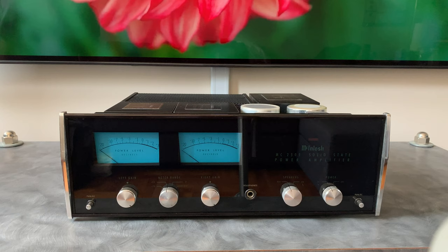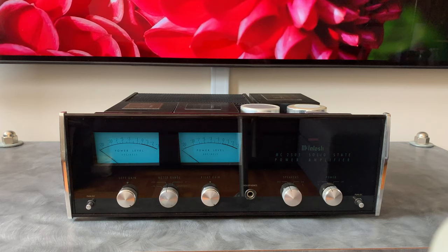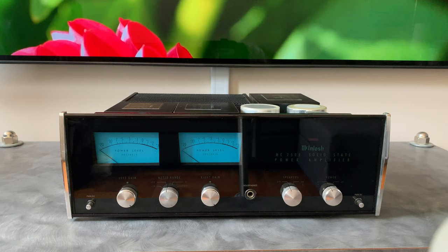As I mentioned earlier, there's different versions of this piece. When I put the new glass on, I noticed that the meter range indicators for off, 0, negative 10, and negative 20 were shifted by one position. So I actually had to go in and modify the connections on the back of the switch so that the switch would match up with the new glass. Just a note on that. So this piece is an early serial number with the glass produced from the late version.